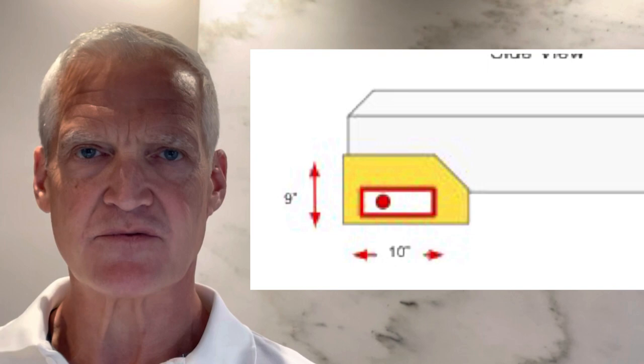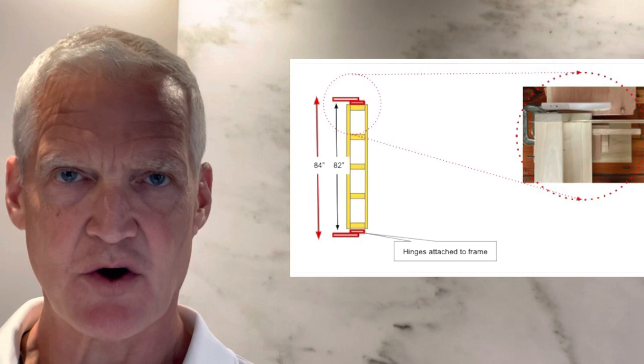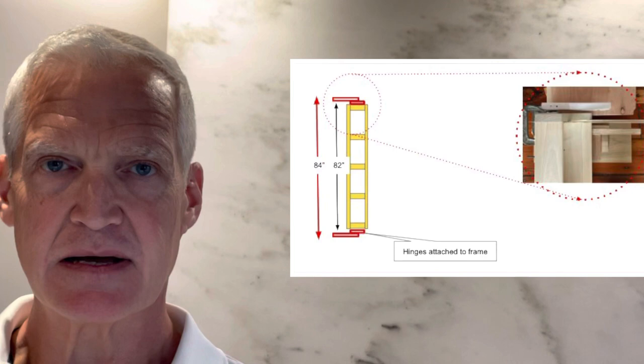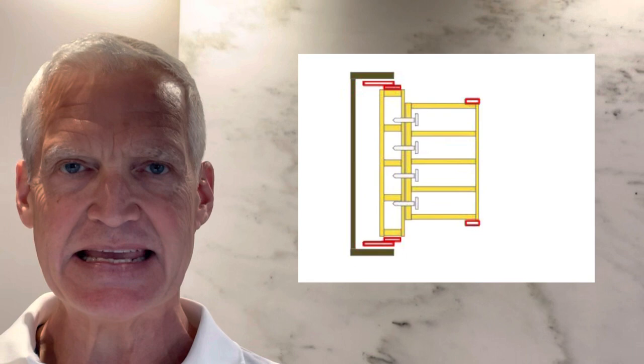D, the width of the bed frame with the hinges attached. After you've figured out where the hinges are going on the bed frame, mortise them in — I simply clamped them onto the bed frame — to get a total width and understand the clearance required to get the bed frame into the cabinet or into a subframe designed to hold the Murphy bed hinges.